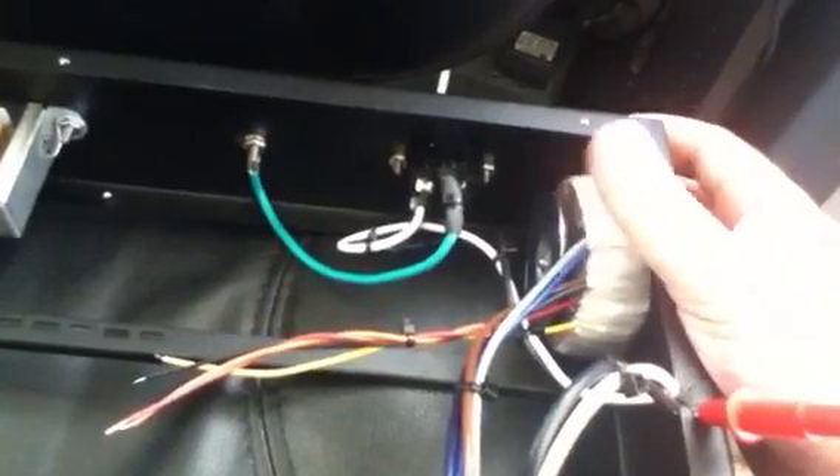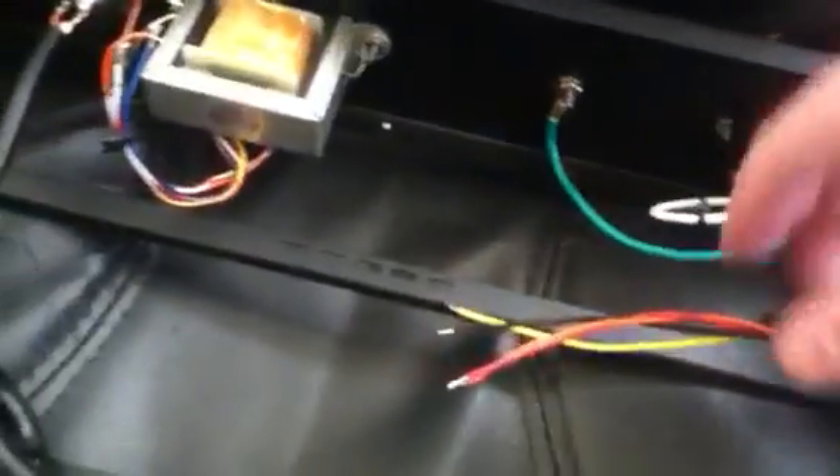Your negative and positive — your hot wire — comes out and goes into the PCB switch for your on/off. This powers the unit on and off. Your negative and positive go in, then the output goes into the power transformer, which does the conversions for the power, and then it goes out to the PCB and powers all your components. Make sure you get your connections correct and use the right power transformer, or you could ruin the whole project.